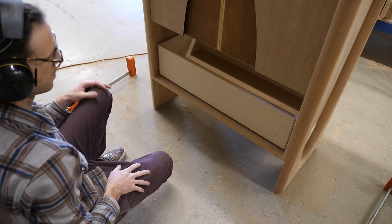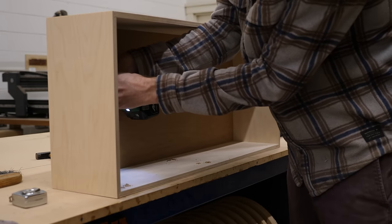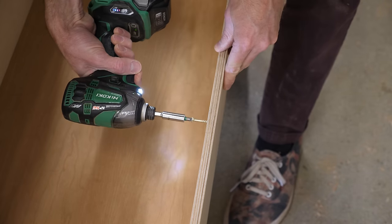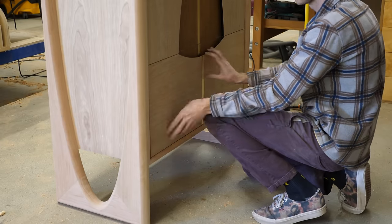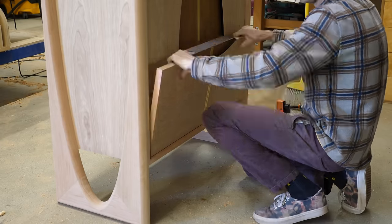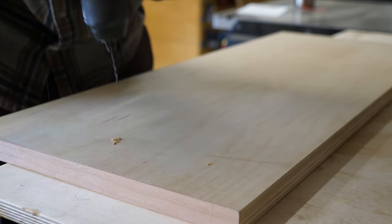Sometimes you can be given all the tools and technology, and if you can't follow the numbers, you're going to have a bad time. Luckily, I made the drawer box slightly too narrow, so I just had to add a small spacer between the cabinet side and the drawer slide to get things working properly. Given the situation, not too bad. Because I obviously hadn't attached my drawer front yet, there was really no issue — I only attached it once the drawer box was fitting properly.